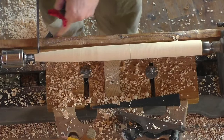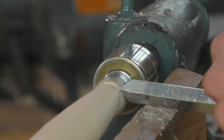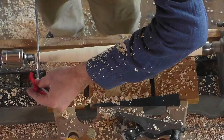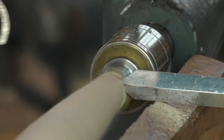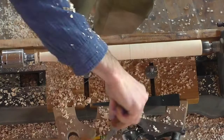Same principle — this stays square here. Find that bevel, lift up. As I'm cutting, I can kind of twist my wrist a little bit, which will help it wiggle in and not jerk. Then I can slide this over the top and go until it slips over. The bevel's rubbing the entire time on this cut. It's starting to burn, so maybe I'll make it a little bit wider. We need to take off all the wood that gets us down to a straight shot between the bottom of that part I just made.